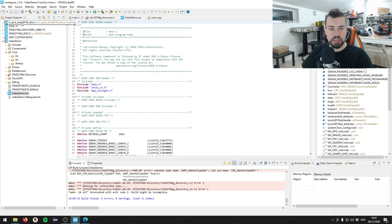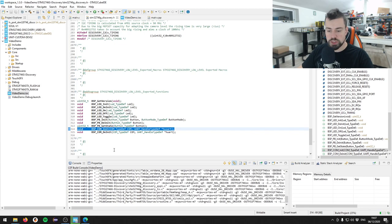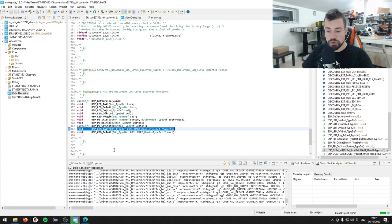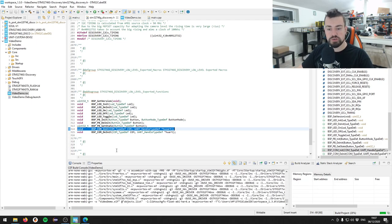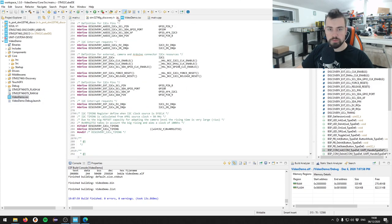It certainly looks like it built. Just by adding the UART port - and you'll probably want a serial port at some point anyway. If you're following this tutorial using the F746 discovery board, USART6 is the serial port available on the Arduino headers. So now we have a system that builds and we've included all the files.